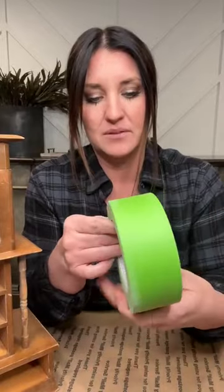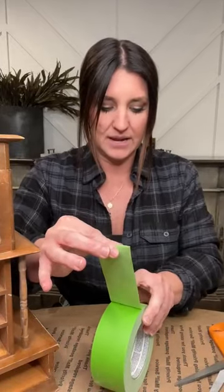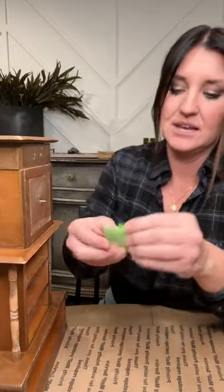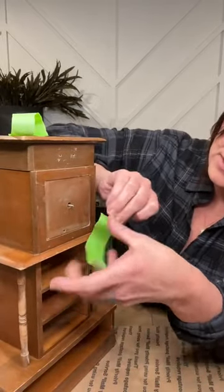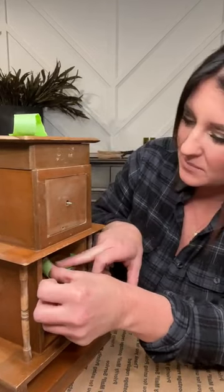This is really wide tape — we can break this down and use half of it. Whenever I'm taping a piece, yes you can rip the tape on your own, it's easy to rip painter's tape. I always have scissors handy in case I need a sharp edge — if I'm working on something with a framed edge you always want that sharp edge. But I can rip this in half and use the rough edge on the interior and still have my sharp edge for the outside piece.